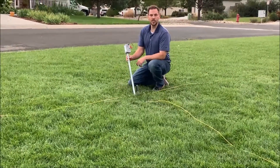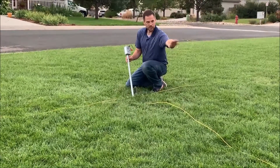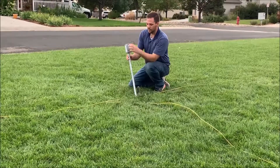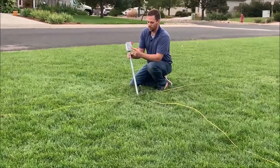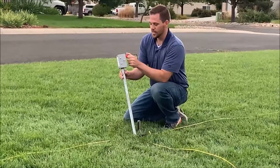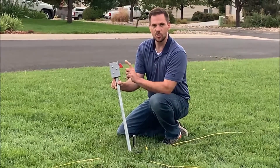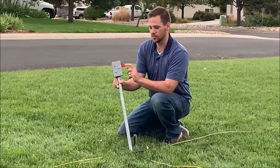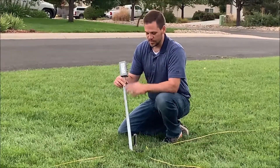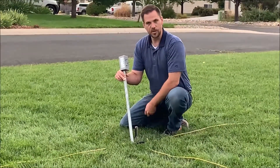The triple is used in a location where you would have an intersection with the main line and a lateral. Here we have our lateral, which is where the locator will be hooked up, and we have downstream that way and upstream that way. We have a terminal for the downstream leg, a terminal for the upstream leg, and a terminal for the lateral line. This has the optional safety switch — it's purely just an indicator to show what current grounding configuration this is in. This is for the electrical industry, since it's red. This would be buried at about 18 inches below grade, providing the grounding configuration, but we just drove the ground rod here as well.